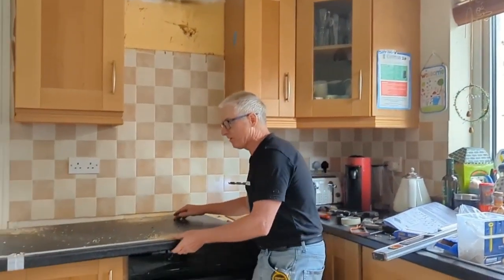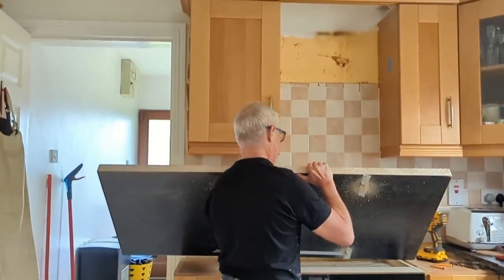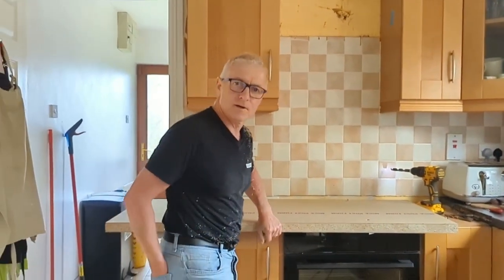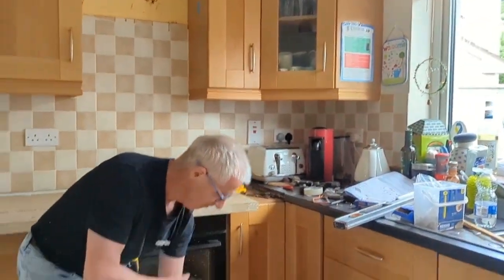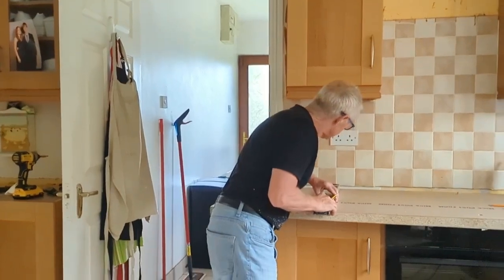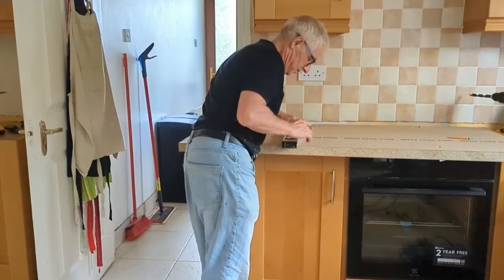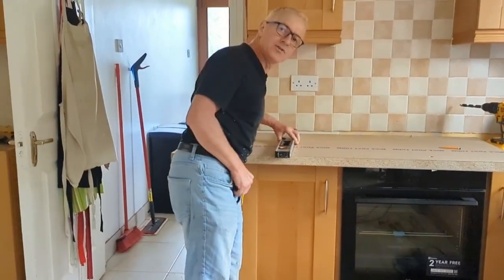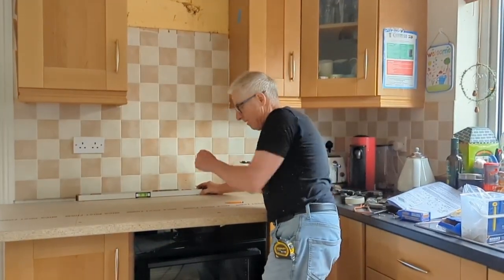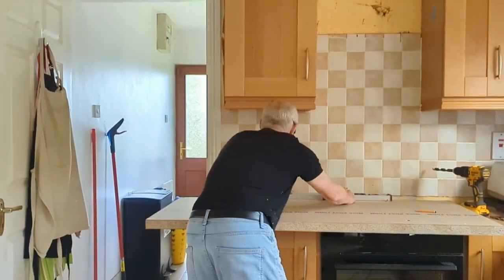All I have to do with this now is invert it — turn it upside down. I'll take my square or my level and just go to each hole and join the corners there, come tangentially off the corners. I'll have this inset equidistant from the front and back surfaces off the top — so in this case it works out about 48mm.